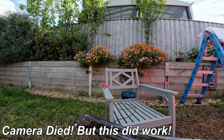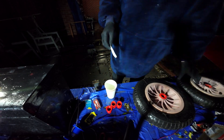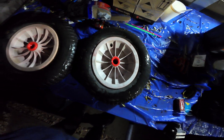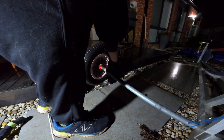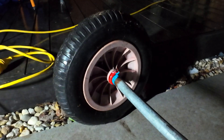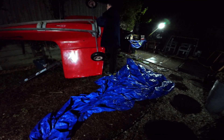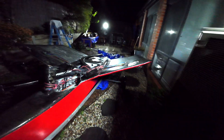This was another job I didn't see coming. The trolley axle that came with the boat didn't fit the trolley wheels I had off the trimaran or my old moth, so I had to 3D print my own wheel bushes to adapt the axle to suit the wheels. I thought Araldite would hold them in and cable ties would stop the wheels sliding around. Unfortunately I've since been proven wrong on both counts — the bushes have fallen out and the wheels are sliding up and down the axle. That needs a rethink. But at this point I was pretty happy I could wheel the boat around.